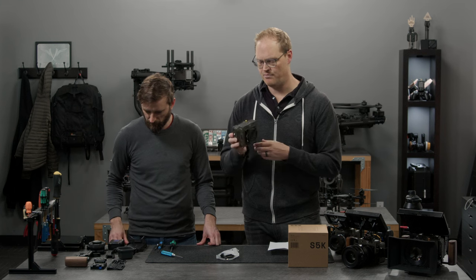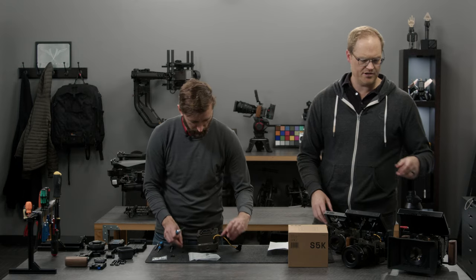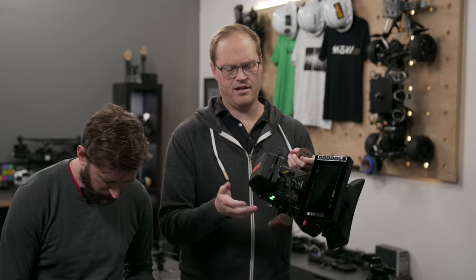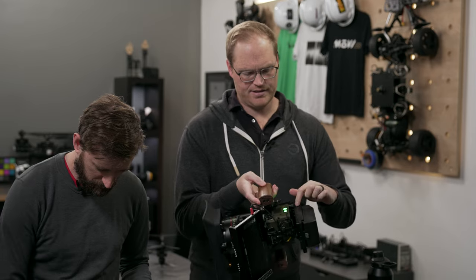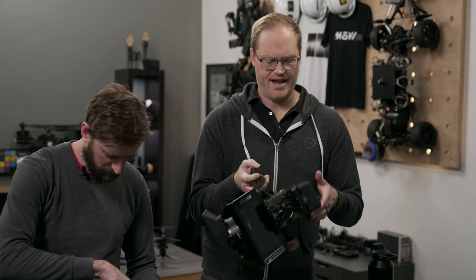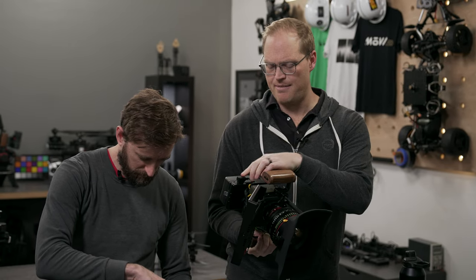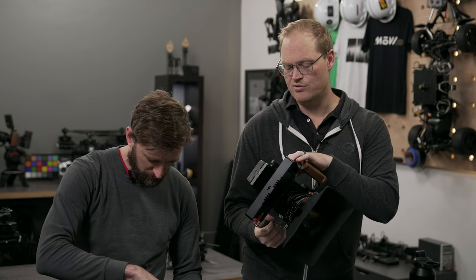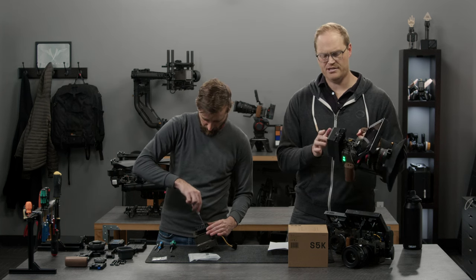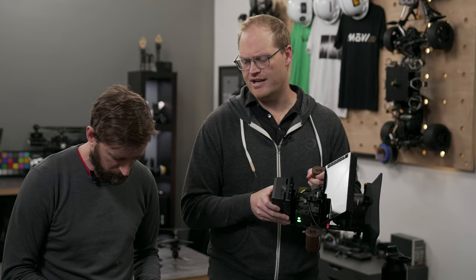This camera generates a lot of heat, so heat management has been one of the tougher challenges. Next up is the cheese plate. There are two main power options for Ember. On mine I'm using our SL4 battery and power hub — it does 100-watt input and two 100-watt outputs, so you can power a MacBook, iPad, camera monitor, whatever. It also has a D-Tap output and a high-power XT90 camera connector. The camera draws around 40–45 watts, so this battery runs the whole setup for around two hours. If you're running the smaller FX Lion battery, you'll get maybe an hour and 20 minutes.